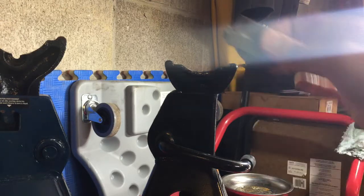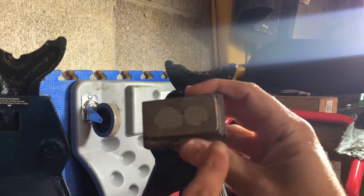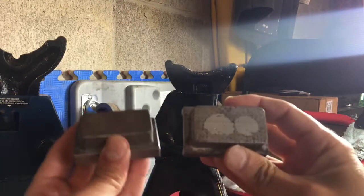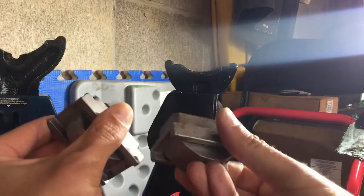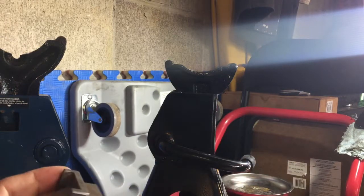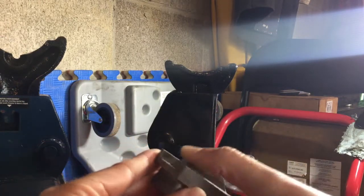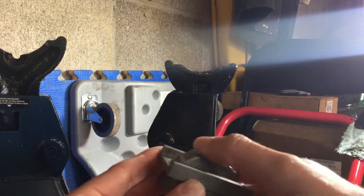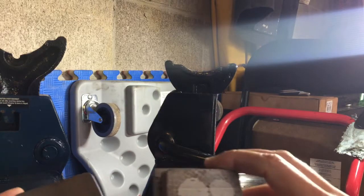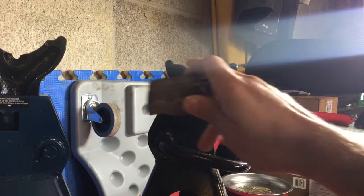The width there is fine, and this is the part that fits into the BMW holder. I have two made — one with the plug weld method where they turned this first, and another where they milled it as close as possible to a circle. It doesn't have to be perfect since this is only a backup, but I'm going to have to make a different profile for this one or just make them flat across.